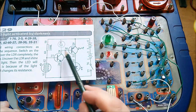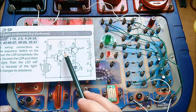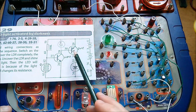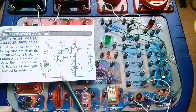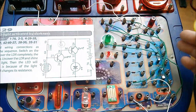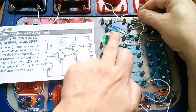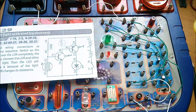Would that reduce the gain? I can't think at the moment whether that would, but it would certainly protect both these transistors from a very damaging large current flowing down that route. So let's at least just see if it works — this link here, which is collector NPN to base PNP, let's take that out and route these two down to the 10k resistor.